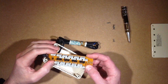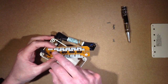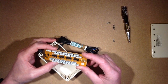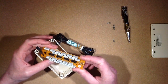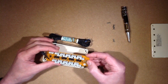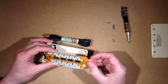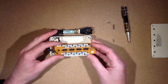The Dezac BreatheEasy ionizer — to be quite honest, a bit disappointing. All the components are correct: it's using the typical 630V capacitors with 10 nanofarads, and probably 1N4007 diodes — rated 1000V. The only slight variation from a normal ionizer is the use of four resistors instead of the more common two 10 megaohm resistors. But yeah, a bit disappointing — not the construction I'd have preferred, but worth opening and taking to bits anyway.